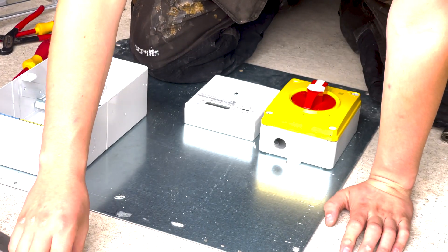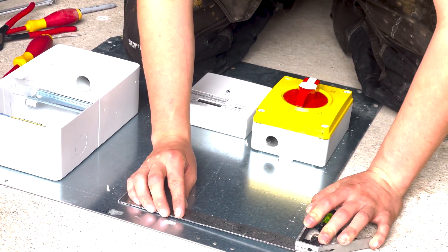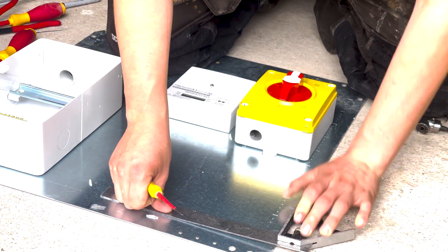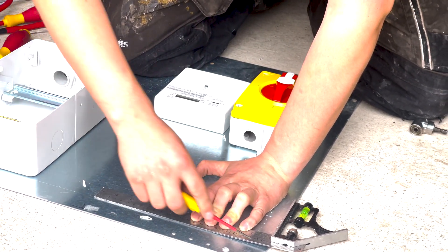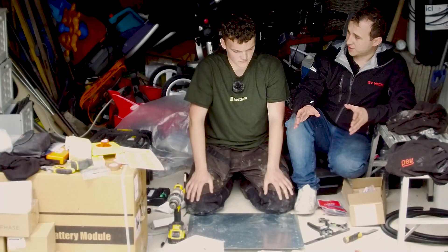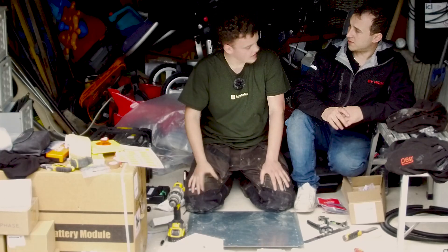So what's going on this board altogether? We've got your consumer unit, the comms unit for the Enphase — that's where your CT clamps come through for the communication. There's an AC isolator and a PV meter going on here as well. And there's no DC isolator on this at all? No — literally everything coming down from the roof is AC.